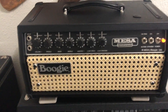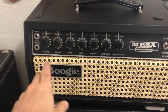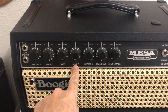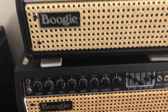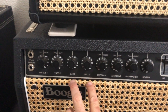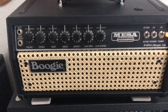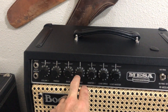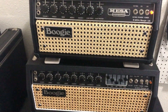So here we have a 2C plus. One of the ways you can tell a 2C versus a 2B is that on the C's and C pluses, the middle is not a push-pull. Whereas on the Mark II A's and 2B's, the bass and the middle are not a push-pull. And then on Mark III's, they're all push-pull because this is the push-pull for the third channel — Mark III's are a 3-channel amp, whereas the Mark II's are a 2-channel amp.